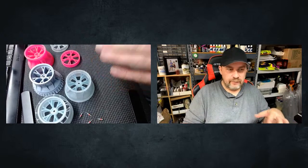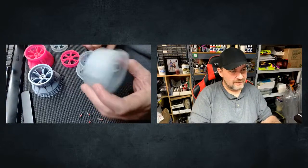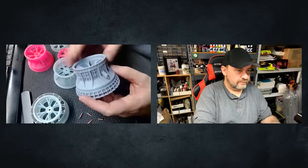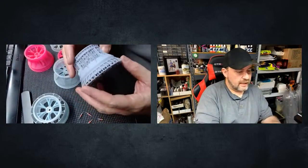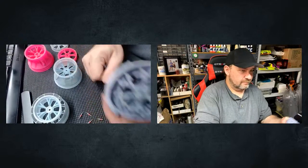One thing I want to explain about printing tires: the rear tires take about three hours to print, and I've played with pretty fast printer settings to get them even that quick. When they come off the printer, you can see all the supports — everything's done at a 45-degree angle, which is a nice angle for building. So these are all the support structures, and when I go to actually clean them up there's quite a bit of work to get to the finished part you guys see.